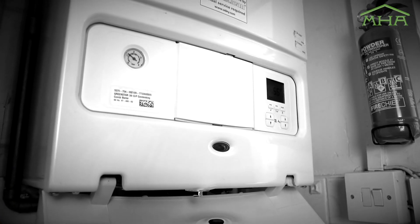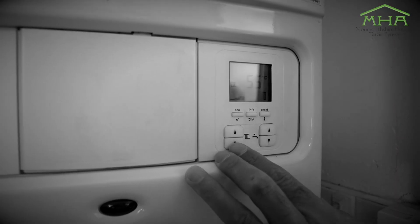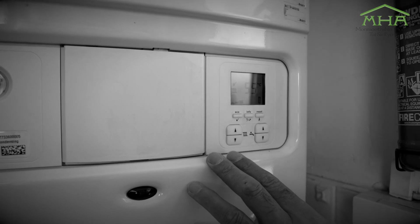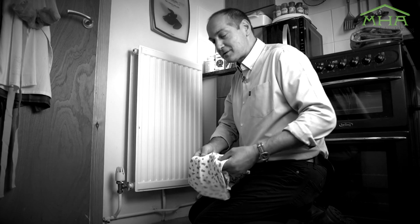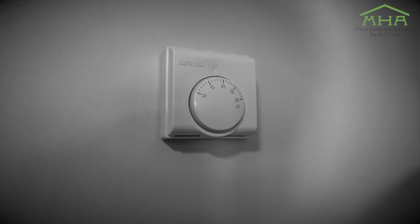Just to summarize: make sure that the heating control temperature on the boiler is lower — aim for 55 degrees if you can, but make sure it's comfortable for you. Your thermostatic radiator valves and radiators — try not to cover them; keep them free to let that warm air circulate around the room. Also your room thermostat — lower that down if possible.